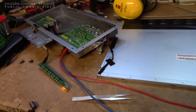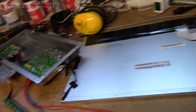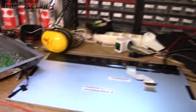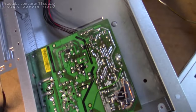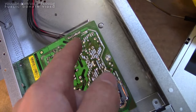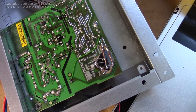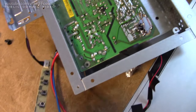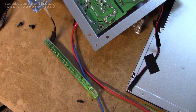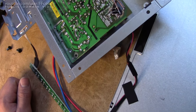I just connected it up using the original power supply, acting as mains from my bench supply, because I noticed that there were two actual power supply rails going to it. The LED driver switcher seems to be grabbing some sort of logic supply from one rail, and that was not pairing up when I was initially testing it. Now it seems to be working just fine — showing the BenQ logo, turning off, turning on again for no reason, and then it'll stay on for a while as BenQ monitors tend to do. That seems to be working just fine.